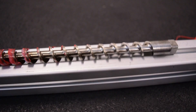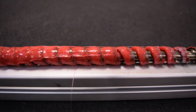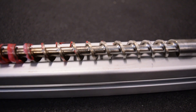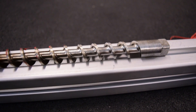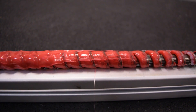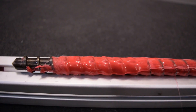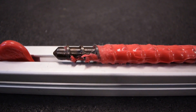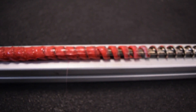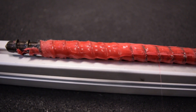That's how you get consistent filament — how long your metering section is. You can also have other problems where your compression section angle and length might not be right for the polymer. This screw is designed to work with a lot of polymers, and you can basically adjust the performance based on the screw speed. It's a pretty versatile screw — it's the screw that comes with the EX6. You can basically extrude any polymer you can 3D print with, by varying the speed and temperature.